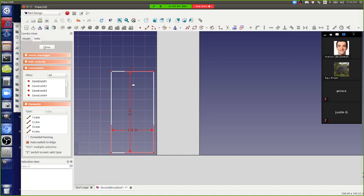So when you screw it in, it'll just start fragmenting. Yeah, it's going to split. 1 inch is going to split. You could see how those little pieces start splitting. More than 1 inch. I would say more than 2 inches. I would start at 3. 2 inches, I could still see that splitting. 3 is like, okay, that's good. Possibly even 4, but 3 minimum.